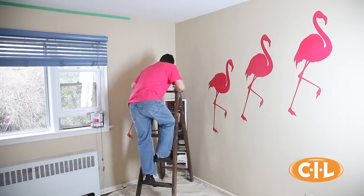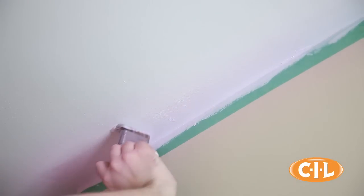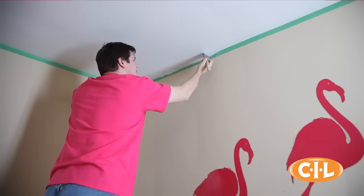If you see any damage, make sure you sand and fill in any cracks. Using an angled brush, you'll paint a line on the ceiling a couple of inches wide just where the wall meets the ceiling. That'll make it nice and neat when you go to roller.